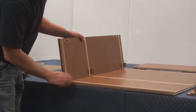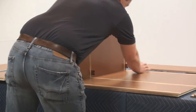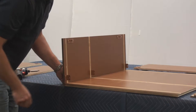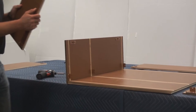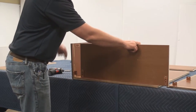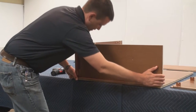So we're going to line that up and get it to fit in nice and snug, making sure to keep the dados on the back and the side panels lined up. Now we're going to go ahead and install the top panel. We're just going to line the dado up in the back, slide it down so it meets the male receiver, and clip those together.